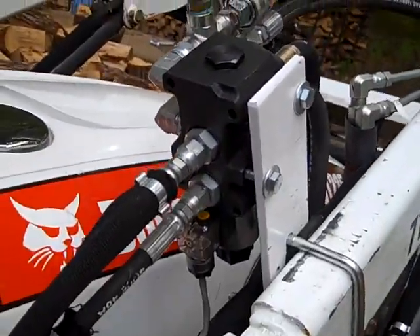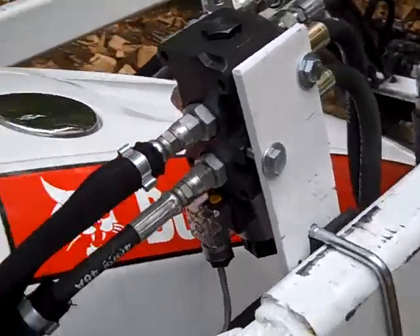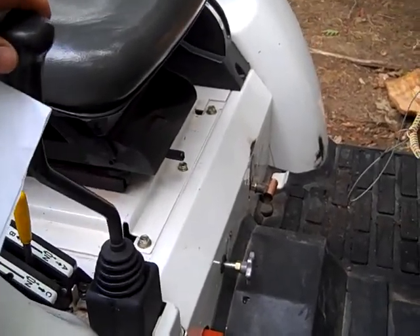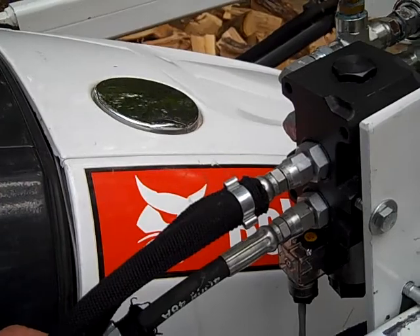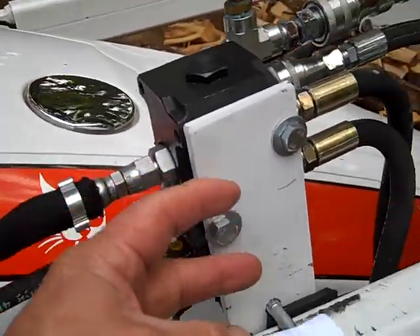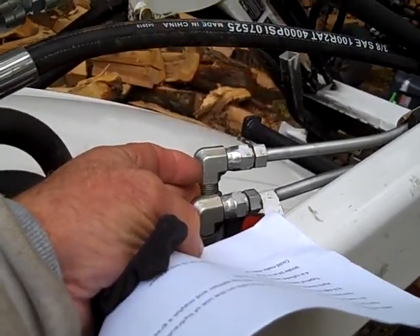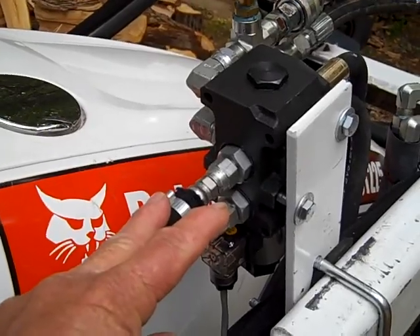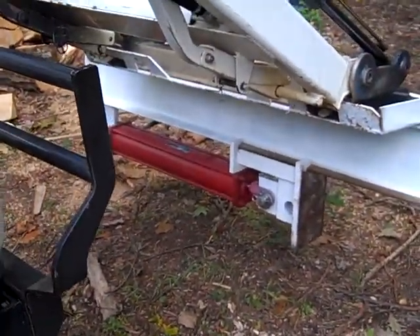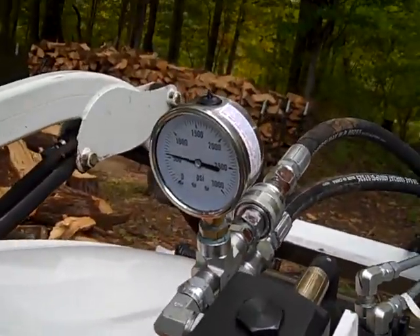What the diverter valve does: typically the 3/8 lines come from your loader valve. Your loader has boom up/down and tilt up/tilt down. What the diverter valve does is — you take your two lines that would generally be tilt up and tilt down, they go through the diverter valve and work as they always would — in and out to your tilt lines, nothing changed. Then you activate the switch, and you're borrowing those hydraulics to run something else. When I flip this switch and power the diverter valve, the hydraulic flow normally used for tilt will now function my hydraulic cylinder to split.